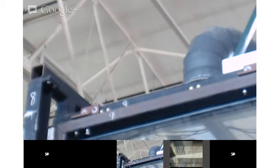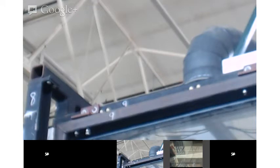But when we do get everything hopefully fixed here, you should see the first row of tufts. They are a little squirrely. That's the leading edge vortex. The ones after that are more or less aligned with the free stream, and you'll see them slightly turn out towards the tip as the spanwise flow gets stronger. And then hanging off the tip are those three long strings. If you're actually here, you can see that they are spinning in circles as they are in the tip vortex. If we have the smoke going, that would be even better, because then you could actually see the whole thing and see how it gets dispersed off the end there, but unfortunately we don't have that.